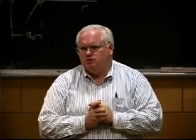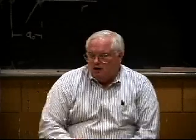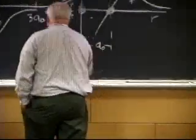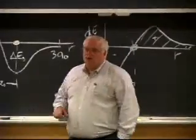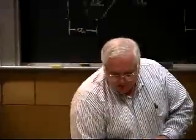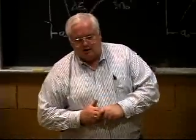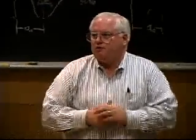And one of the students says, well, how do you calculate that? So I went back after class and I did the problem. Okay, so now I'm handing it out to you. Basically, you start with the Lennard-Jones potential, and you say, well, all I have to do to figure out if I have two atoms together here is integrate F dot dr, and that's the energy necessary to pull those things apart and separate them if they're bound together, right? And if I do that, I end up with some number that's 1.3 times 10 to the 10th newtons per square meter, which is about 13 gigapascals, which is about 2 million psi for a typical surface tension of iron.